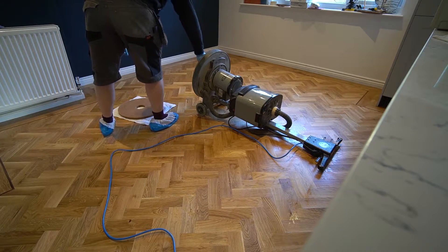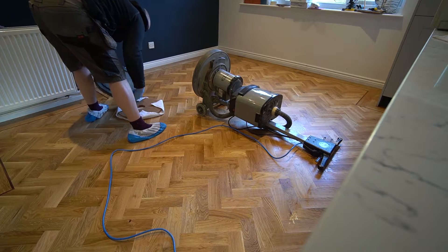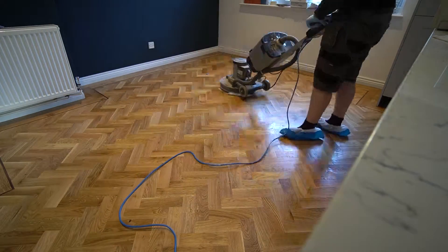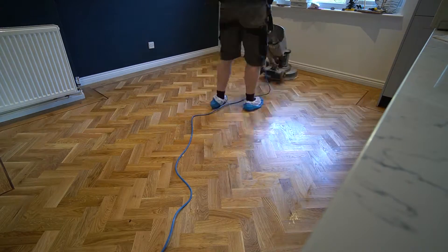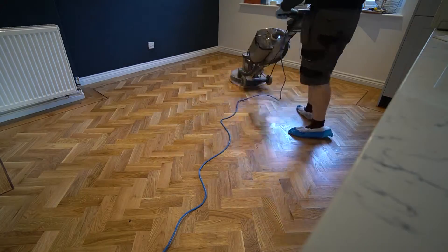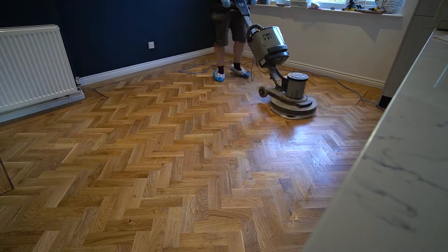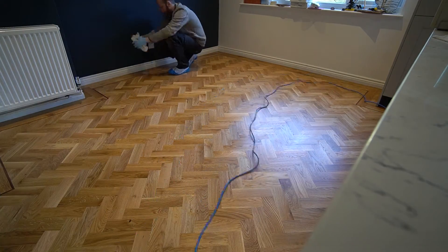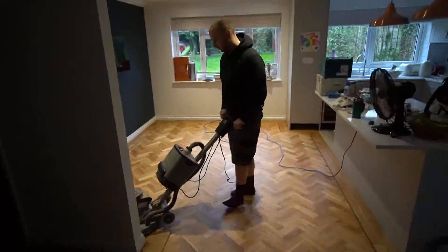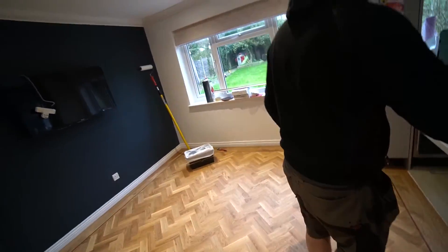It's a very satisfying job this. Already you're starting to see the color and variation, which I just love about this floor and this finish. There I am wrapping — I think I've put a new, dry tan pad down and wrapped a towel around it like that, just to buff the excess off the surface. You can see my helper rubbing down the edges, taking off the excess. I think this is the next day — it had a good 18 hours to dry.